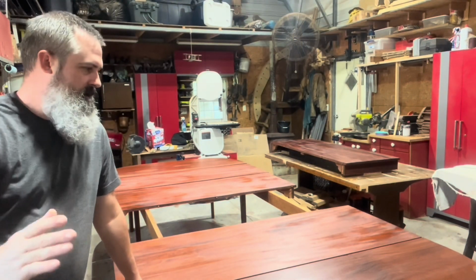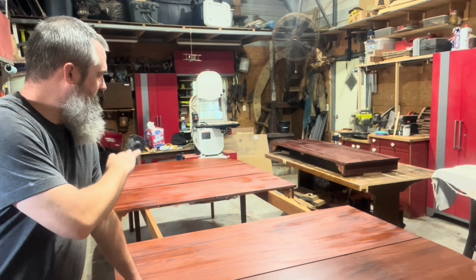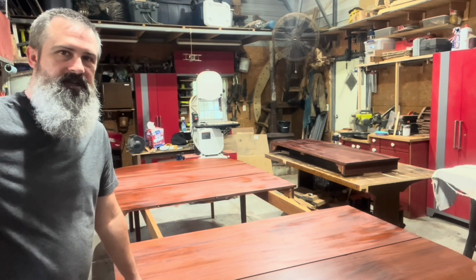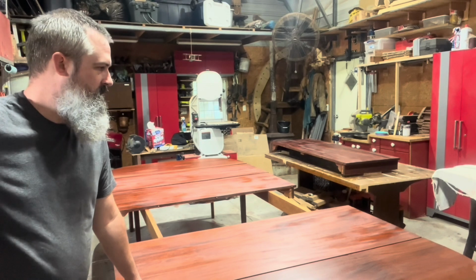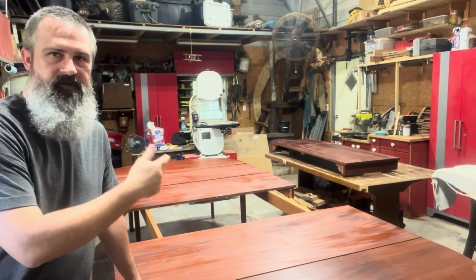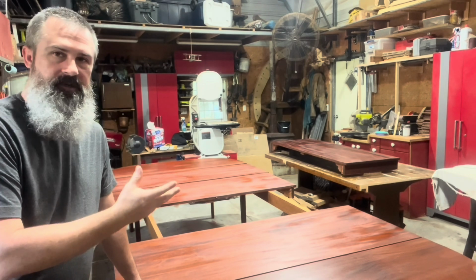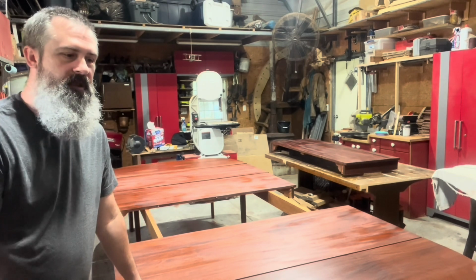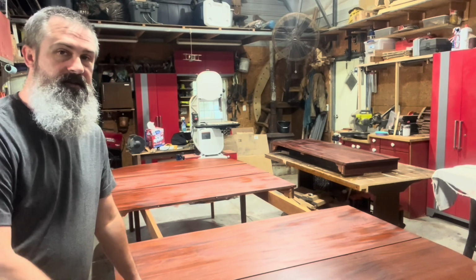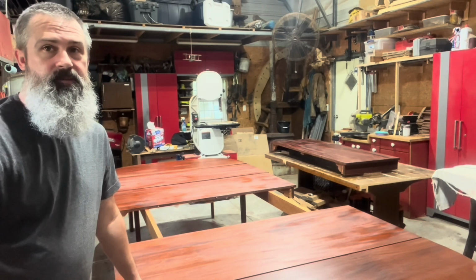All right, so I have 1 full coat of polyurethane over the entire thing, and now I'm going to get started sanding with 400 grit sandpaper. It's cured overnight. The dehumidifier was on, about 56% humidity in here, which is good for curing. Just going to start sanding and apply the next coat of poly. Here we go.